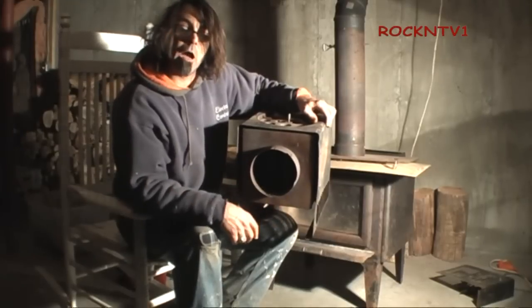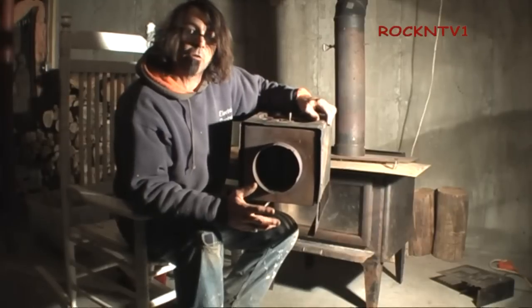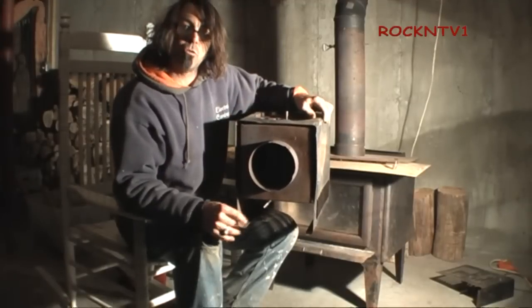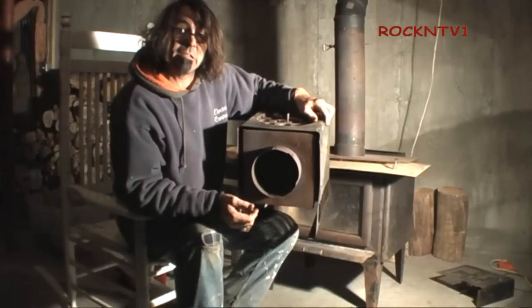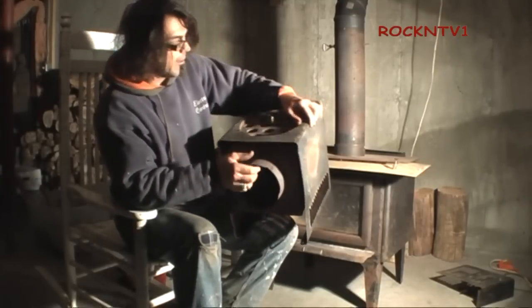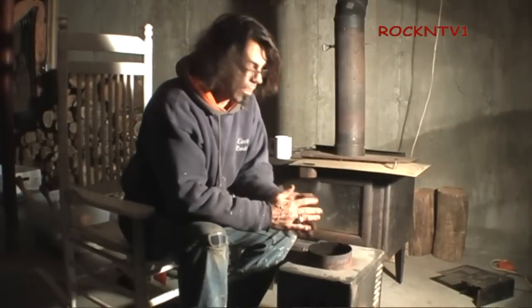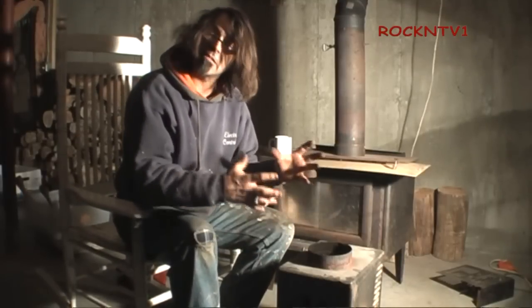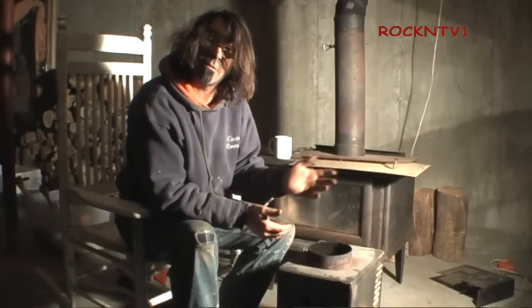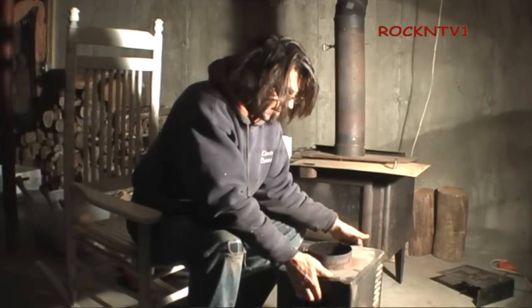The flue gas goes in here, comes out of the chimney, and you're basically pushing air through these tubes past all the fire so that you can pull the heat out. If your flue gas is 600 degrees, you take that air and pull some of the heat back out. The manufacturer says these are good for 8,000 to 30,000 BTUs. This little stove I have here is good for 10,000 to 35,000 BTUs, so we're hoping we can increase efficiency, cut down my wood use, and get some clean heat out here in the basement.